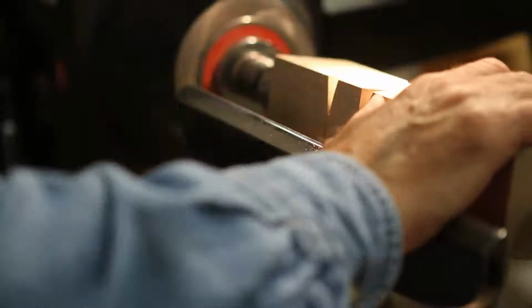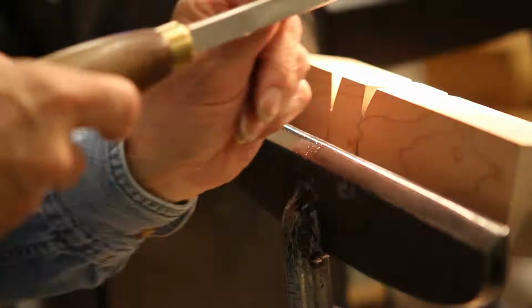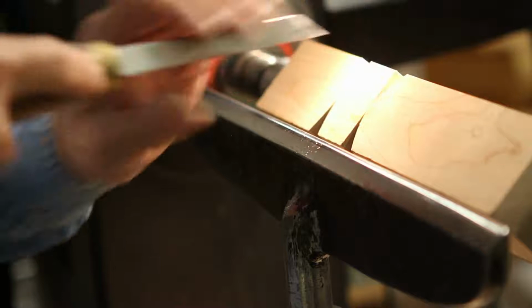If you do that correctly, then when you hold a square against that, it should be a perfectly straight line and not bulge out or in. The way you achieve that is you get this plane, this side of the chisel, to fall exactly in that vertical plane. So that worked out pretty well.